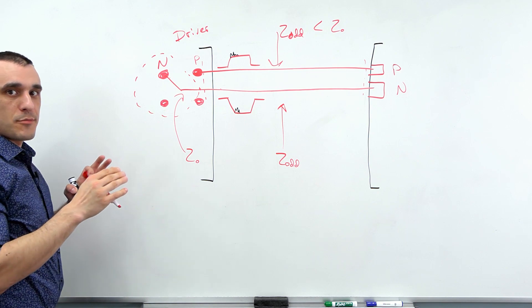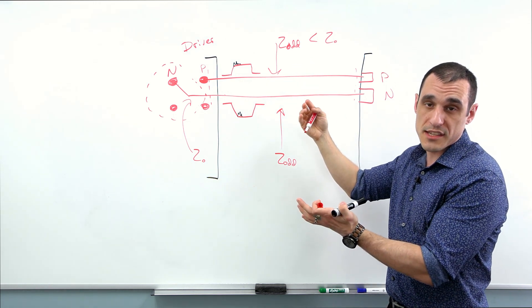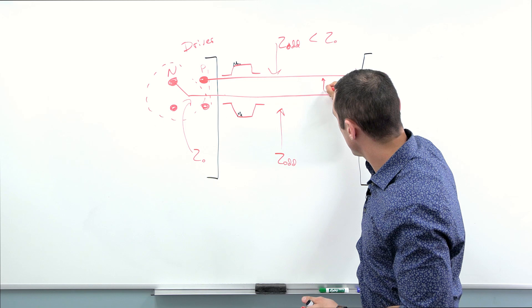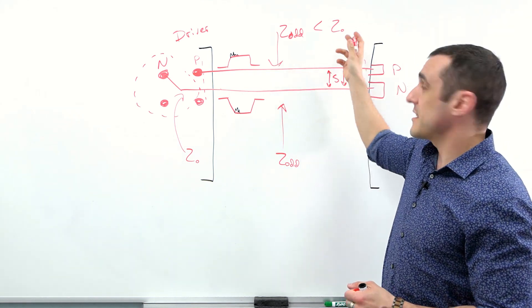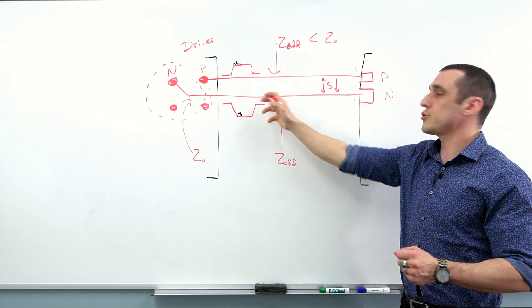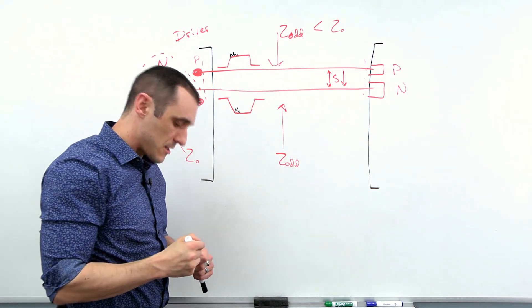This comes from the lack of coupling to the other trace, and I think it's one reason to apply a sufficient amount of separation between the two traces. We don't want them hugely separated because we lose noise reduction benefits, but if we bring them closer together, Z_odd decreases compared to Z_0. When spacing S is smaller, Z_odd goes down. An appropriate spacing will allow Z_odd and Z_0 to be similar enough that the negative trace does not experience an appreciable impedance change as it routes into the parallel section. So yes, there is a slight impedance mismatch in that area due to coupling between the two traces.